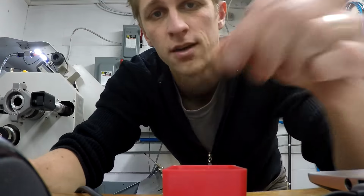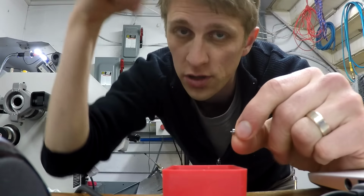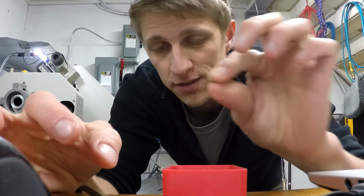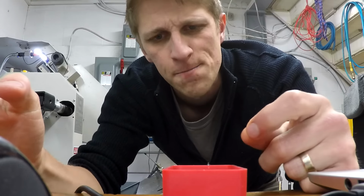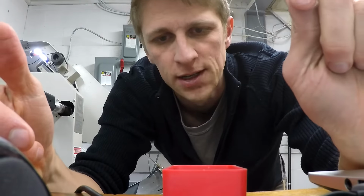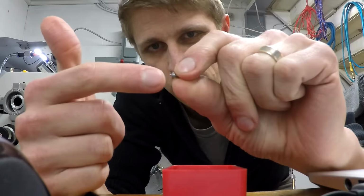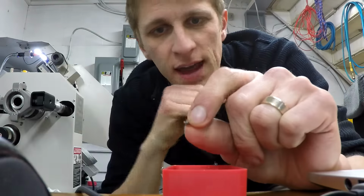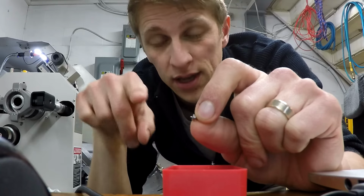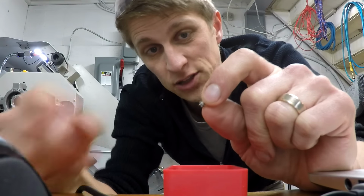Here's a quick little thought that I just had. All these little screws that I'm making, when they come off the machine from the parting tool that cuts them off, there's a long curly Q attached to it, which is kind of handy for finding the parts, but I have to break everyone off, and that means every piece is now stuck in a big pile of chips. A lot of them have little burrs, like stringy bits attached to the threads. So I'm trying to think of ways to lean out the process and make my finishing, my pickup time, a lot shorter. Everyone has a little nib at the end, and instead of parting it off straight through, what if I stop at that nib for half a second and then keep going? That will break the chip and then plow it off, and that should get rid of that big thing.